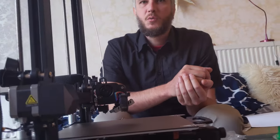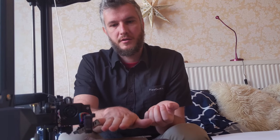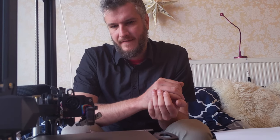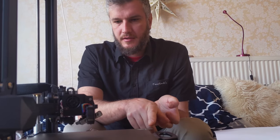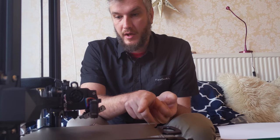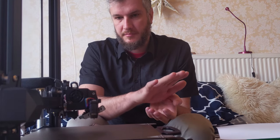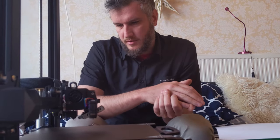Let's put it in the bed. It's going to go to 60 degrees. You know how to tell when it's 60 degrees? 60 degrees is about the limit at which you can hold your hand on a hot surface. So I don't need to use hairspray or anything because it's a pre-heated bed? No, it's a pre-heated bed and it's coated with a special material. If it doesn't stick well, you may need to take very fine sandpaper and just do a few passes to create some scratches.